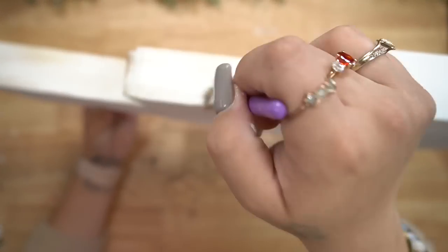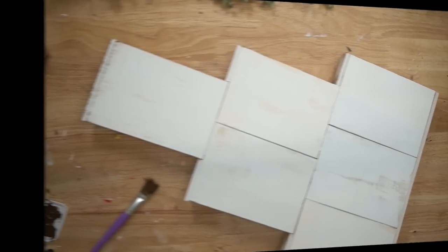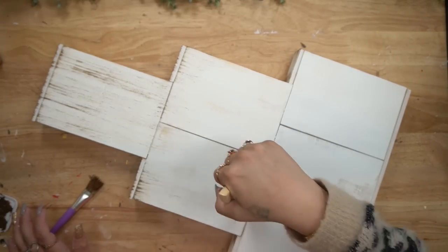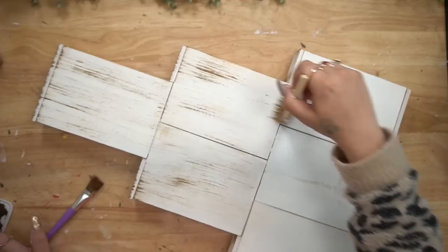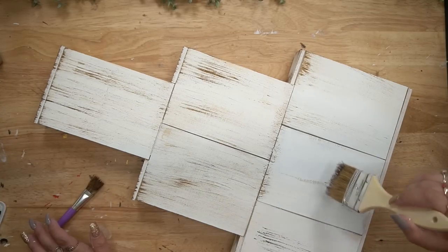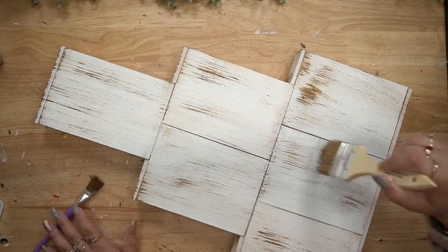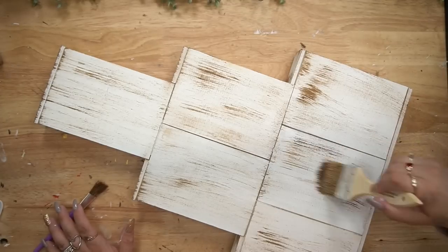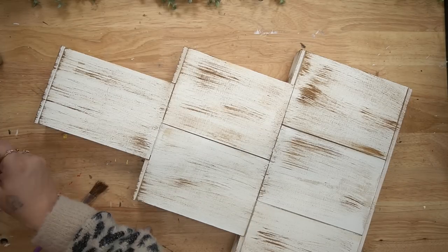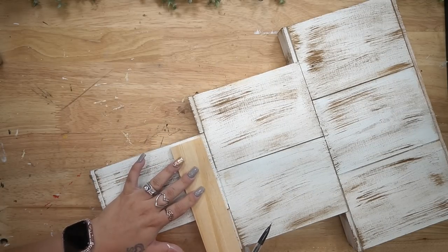Making sure that this is really dry, I hit it with my blow dryer, and then I take these new mini chip brushes that I found on Amazon — also linked in my Amazon shop below — and I dry brush all the way around the back and the sides of this piece. For the back, my small chip brushes felt just too small, so I did take a bigger chip brush from Home Depot and used my antique Waverly Wax to dry brush all the way around the back. There's really no rhyme or reason to dry brushing. I start off very light-handed, and then I eyeball to see how dark or light I want it. If I did too much, I will paint a little bit of white over it until I am happy with the results.